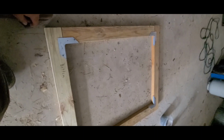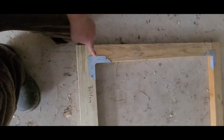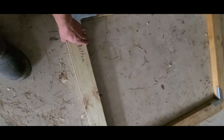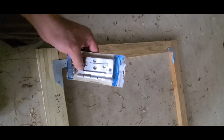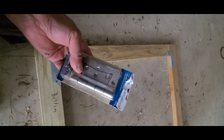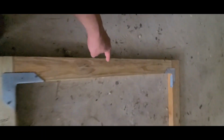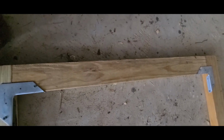Then, once we cut the fencing out of the other area that we showed you, we're going to use the air gun, the air compressor, to put a piece over this and staple some wire fencing to the front of it. That way it's not extremely heavy. Then we're going to use these standard nickel hinges to attach it to that 2x4 that we just set down into the ground. It serves as a simple gate. And then we'll add an eye hook here, so we can use a bungee cord or something to wrap around to keep it closed if we need to.